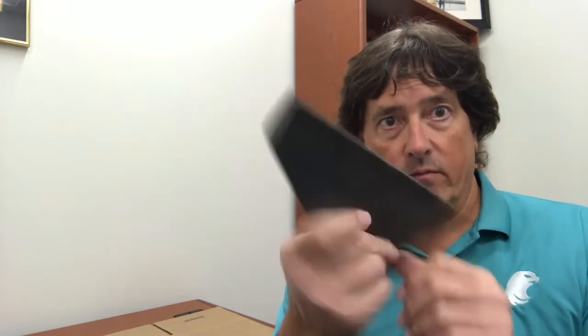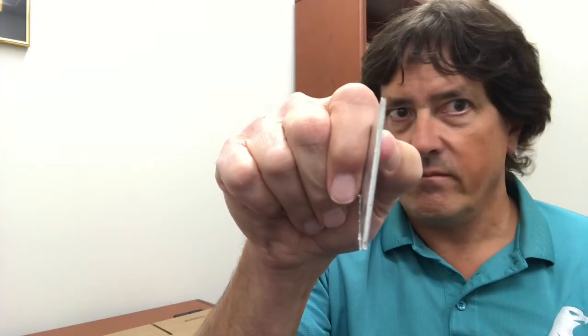So yes, absolutely with a coupling method. This thin piece — absolutely with coupling method — because it's thicker than the absolute minimum of ASTM A1038, which is two to three millimeters. This piece, however — no, can't use this piece. Even with the coupling method, it's too thin. Next up, we'll show you how to do it using a specific instrument and give a good example.